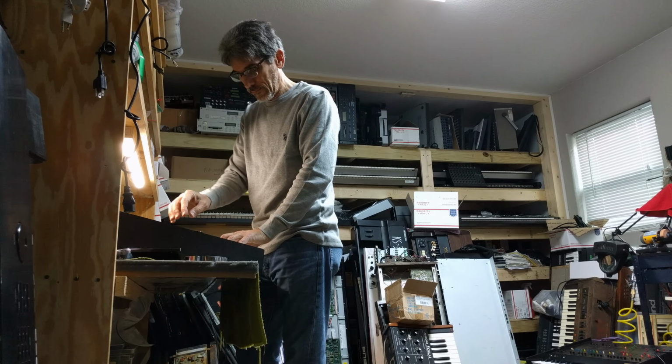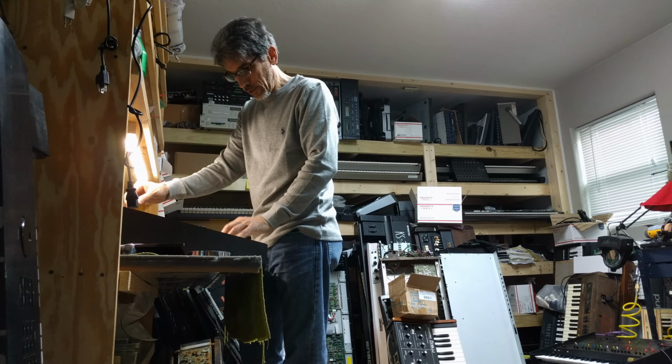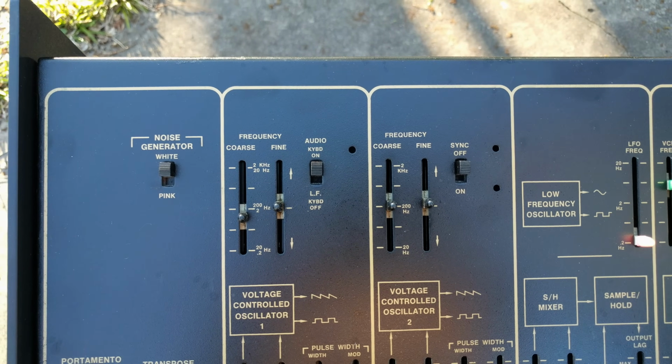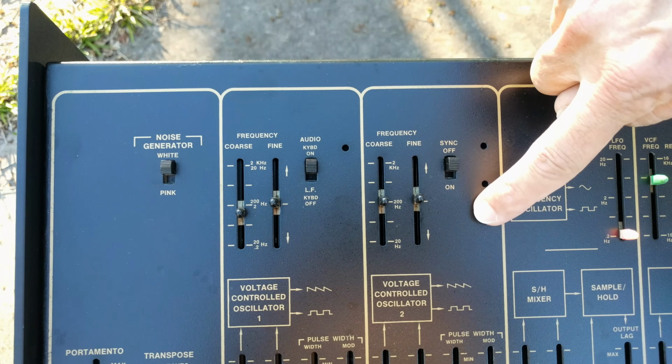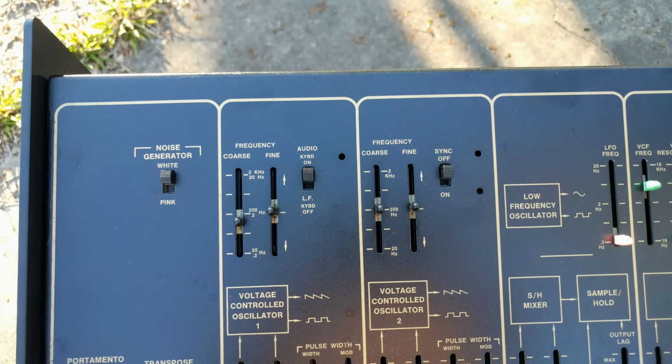That's a big part of what makes the Minimoog sound so fat. Adding such a thing would be a huge undertaking, but adding a sub-oscillator to each of the VCOs is much more doable. This would give the Odyssey 4 oscillators, sort of, and that's something to get excited about. So we set about making this happen.